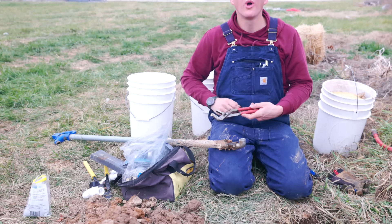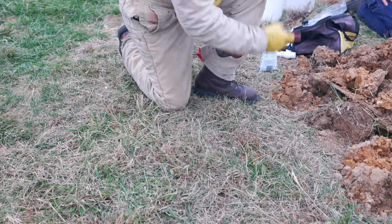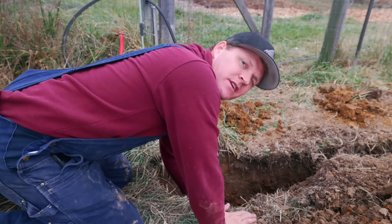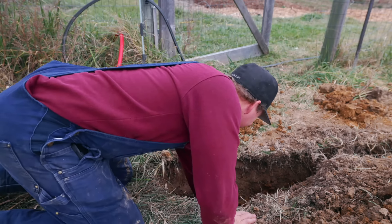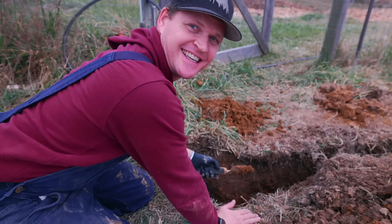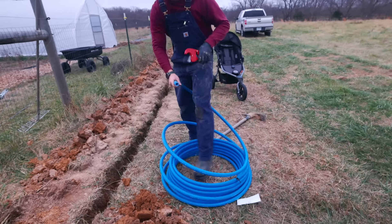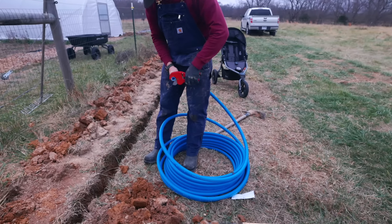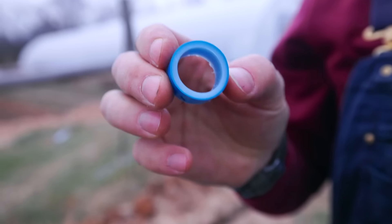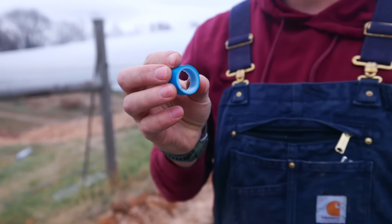This is on an elbow right now so I need to take the elbow off and put on a tee, because this is no longer the end of the line. We got a cutter now — this should go a lot smoother. The other one I had was Harbor Freight. This one slices it like butter, look at that. That was just a practice cut, but this is where the saw had failed, and that's with the right tool — so it's better.